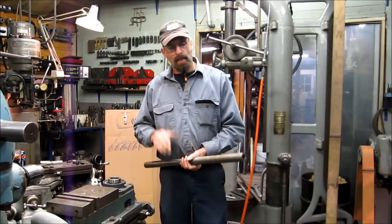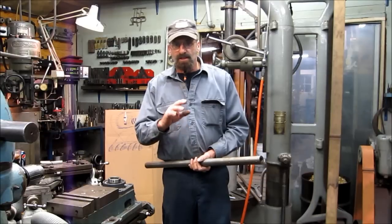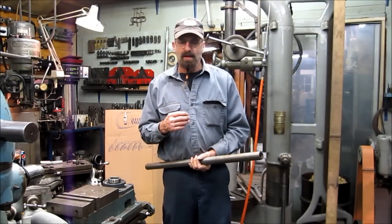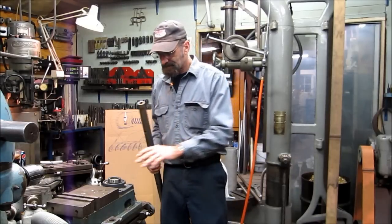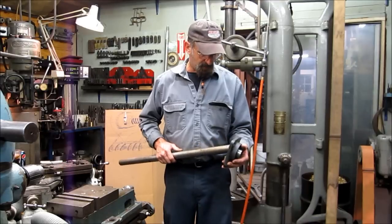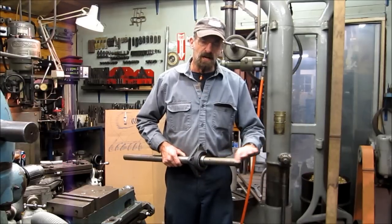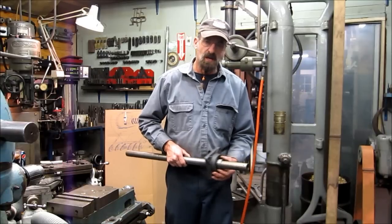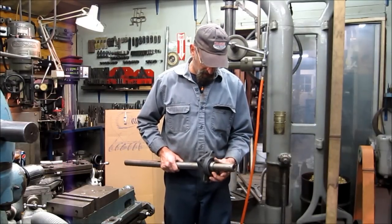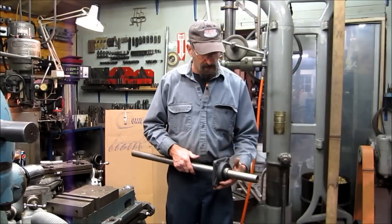Now you need to guide this bar on the path of your bore, and it doesn't matter too much the size or length of your bore. Flange bearings are very excellent for setting up line bores, because your cold roll stock normally comes within tolerance and a bearing tolerance. They're almost ready to use right off the shelf. Go ahead and pull your set screws out so they don't hinder you, because you're actually going to be free-gliding in here.